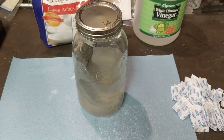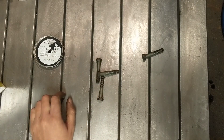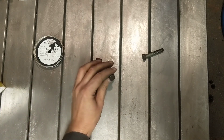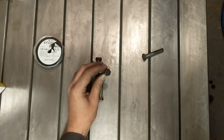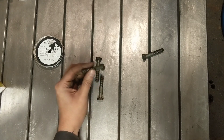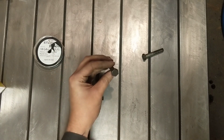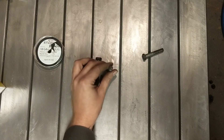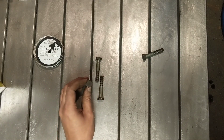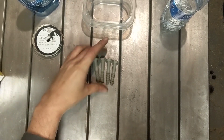Now that we've got our plating solution, we can turn attention back to what we're plating. These bolts are in an utterly hopeless condition for plating because rust doesn't conduct, so zinc would never stick to it, and even if it could, it would just flake off later. So we'll take these over to the sandblaster and get the rust off. I'd show you that but the light's blown out and I'm too lazy to fix it — so there we go, we've got these back to white metal.